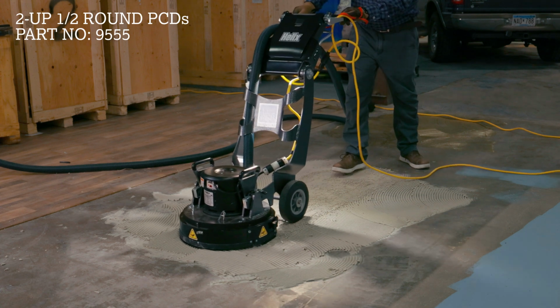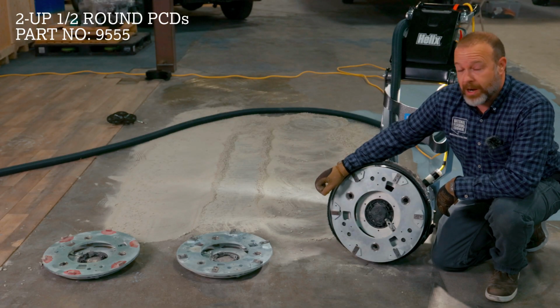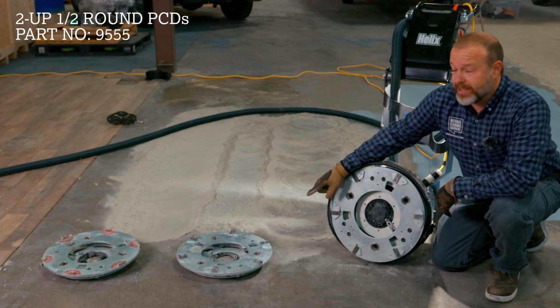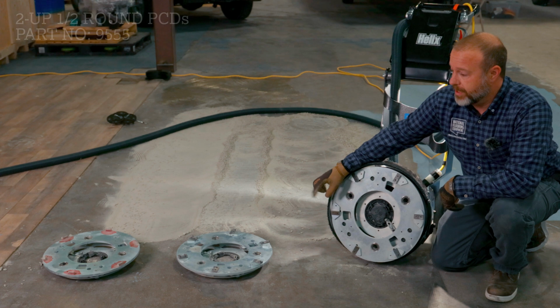But I will also say if you're in a very wet area, or if you're kind of on one of the coasts, you might have some epoxy reinforced thin set, and that's going to be a really great option for doing your removal because you have to go pretty aggressive with it.